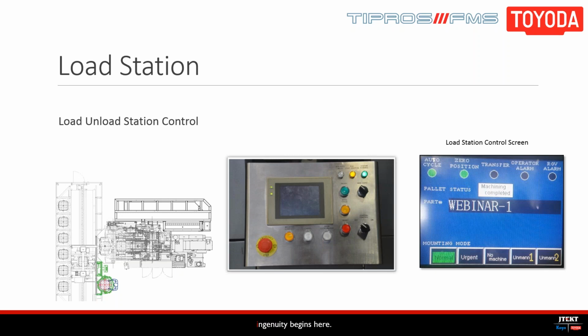Okay, so the first thing we can do when this happens is read the pallet on the RGV to ensure the data in our cell controller is correct. So you press the load button, or the read button, at the pallet, and the pallet number will appear under old data. If you wanted to write a new pallet number, you press the write and enter in the necessary information. But please keep in mind, you can only have one example of a pallet in the system. So only one pallet 1, pallet 2, and so on.